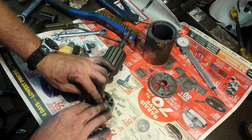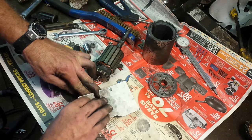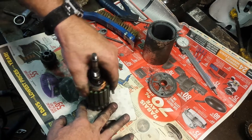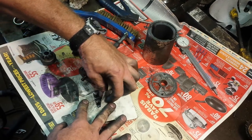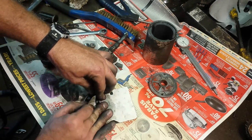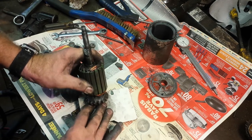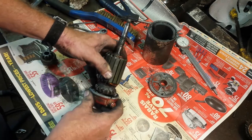I'll keep trying — I don't remember having this much trouble with my other starters. Something's just not wanting to go. Probably because the brushes are bigger, they're wanting to pop out more easily — that would make sense. There's probably a tool for this; a piece of sheet metal works better. There we go — all four brushes are in.